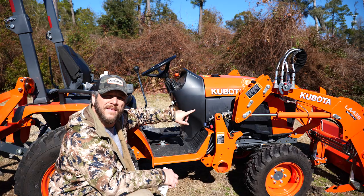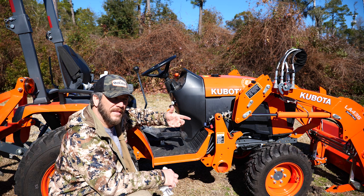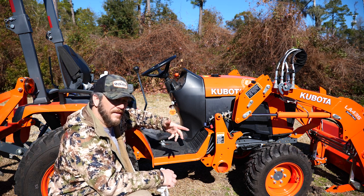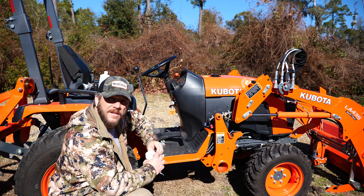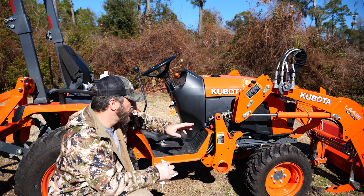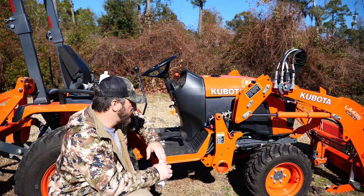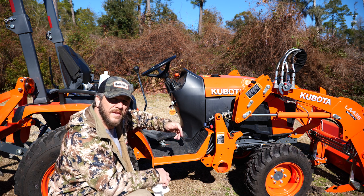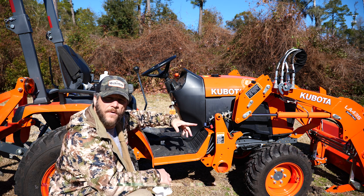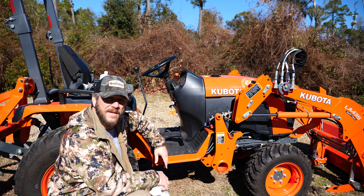I'm going to take a look at this connection for the hydraulics. It appears to be leaking from every one of the lines, or at least three of the four lines from underneath. I don't know if I'm going to need to take it back — it's still under warranty. I've seen a lot of people have had this issue with this front end loader and the new attachment system. I'm going to take everything off, see if anything needs to be tightened up, wipe everything off with some alcohol, and see if there's any grime in there. Hopefully it's something very simple, then we'll connect it back and see how it goes.